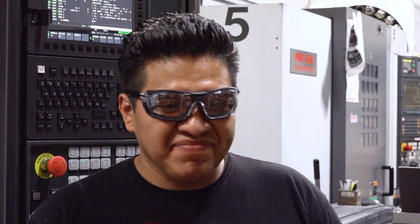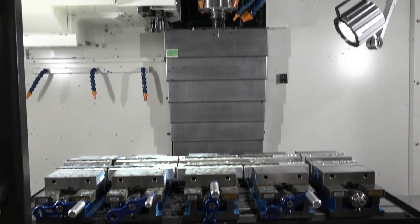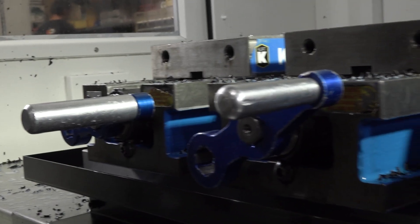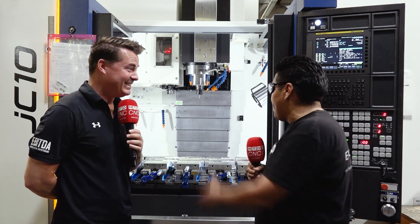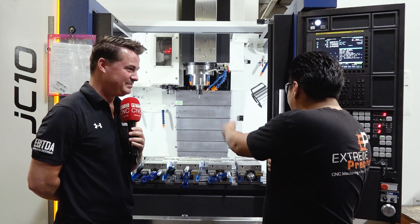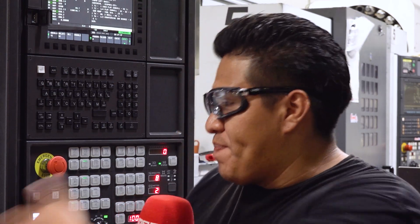30 years experience working on CNC machines, and I'm happy with this brand new machine — easy to use. The famous panel control, and I like that the machine's bigger. I use five vises; you can put many different pieces of work on there. Different work offsets — you can use G54, G55, G56, G59, whatever you want — many work offsets because it's a big table.